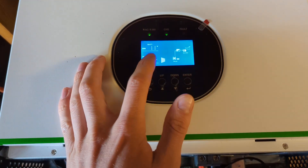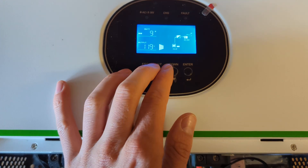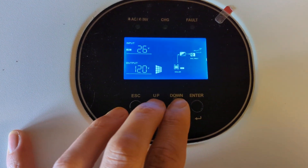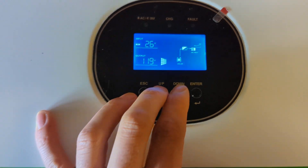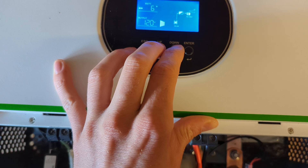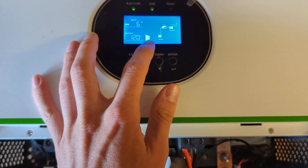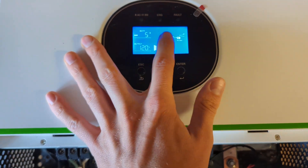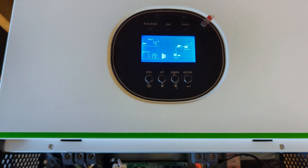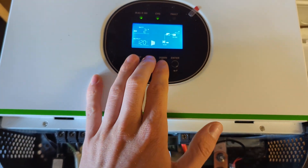Here's the power from the solar — this will vary. I've seen it up to 30 watts. During all of this, I never see the PV voltage change; it just stays at the battery voltage, or 26 in this case. I'm assuming that's because of the battery voltage. I also never see the connection line from the icon for the array to the loads or the battery. I haven't seen that come on — it used to, when I first got the unit.